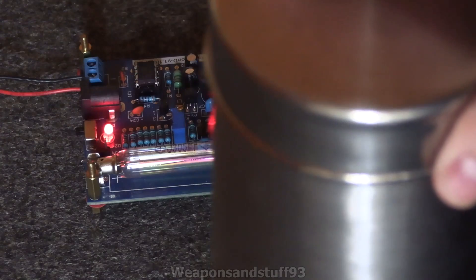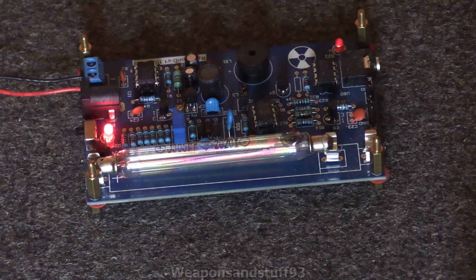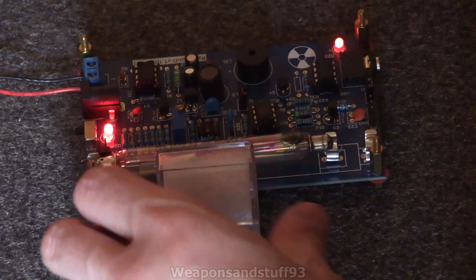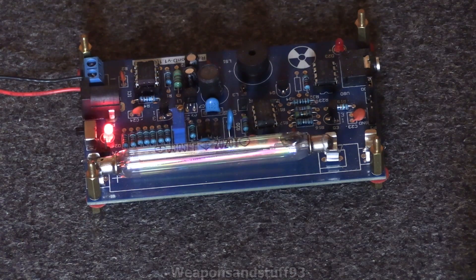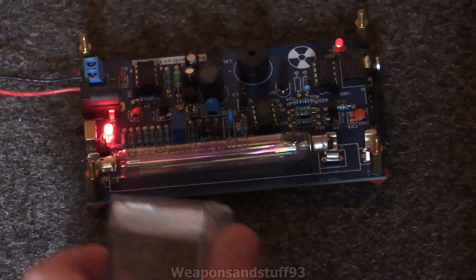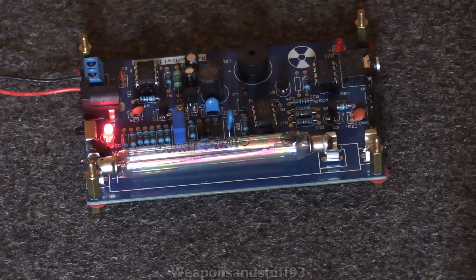Here's my collection of check sources. You can already hear the counter gets louder as I bring them closer. Let's get some of these out. The Strontium-90 is going to be interesting, but let's put some radium near first — it makes a horrible noise. I've got one that's much stronger: a Strontium-90 source from the Chinese Type 75 Geiger counter I bought. That one gives off an amazing 2.5 Roentgen per hour at point-blank range. Some people will say that's beta radiation so technically it's not Roentgens — that's for gamma — but you know what I mean.